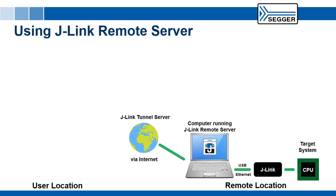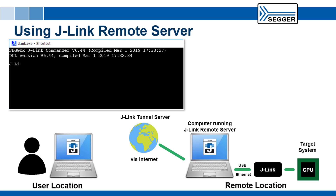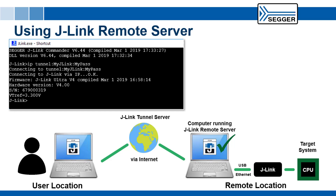From then on, the tunnel server waits for a client to connect and request a connection to the J-Link. Now you can connect to this J-Link from the user location, which is potentially thousands of miles away. We will use J-Link Commander in this example, but you could use any IDE supporting J-Link, for example SEGGER Embedded Studio. Start J-Link Commander and type the following IP command. The J-Link software on the user side then establishes a connection to the tunnel server and identifies the J-Link to connect to by providing either the serial number or the name chosen by the user.